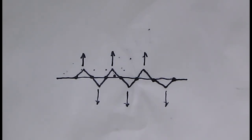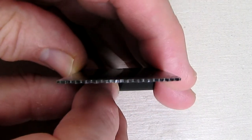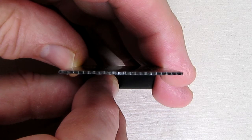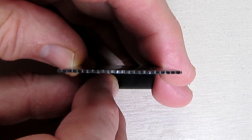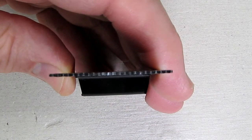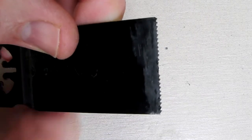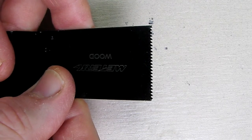That's how you maintain the blade and get multiple uses out of it. Here's an extreme close-up of the blade — you can see that those teeth do go in and out a slight amount. When they create these blades, they use a press that goes in both directions, and you want to duplicate that when filing. You can see what happens to a typical blade — some damaged pieces, it just gets dull. We can bring it back to life to look more like an unused blade.